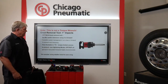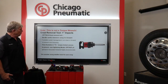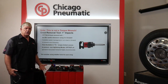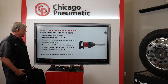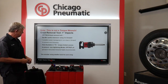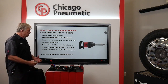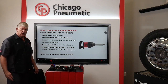I put the one-inch impact wrench in — note, this is not a torque wrench. It's a great removal tool. Be careful using it in forward; these have upwards of 2,000 foot-pounds of torque and in the wrong person's hands, you're going to do damage — you're over-tightening. If you're going to use this as a snugging tool, it's got a three-position forward/reverse; you want to put it in the lowest power setting for forward so you don't over-tighten. We're now also making a TL version, which is a torque-limited version pinned in the lowest power setting. If you're going to do a torquing procedure and use a one-inch for your snug, we recommend that, or smaller tools for your snug.